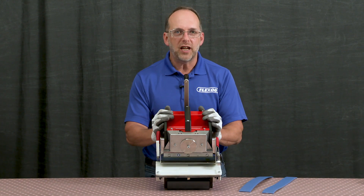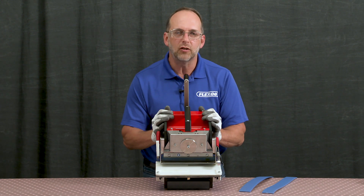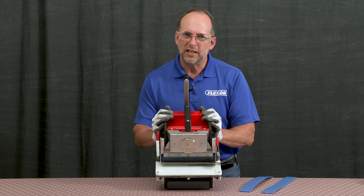I'm here to share with you the NovoTool Punem NDX for cutting 200 millimeter finger lengths on narrow belts. Some of the challenges with current punches in the field are multi-repositioning steps that cause misindexing, belts that don't release from the blades, fraying of those aramid cords, and blade replacement challenges.